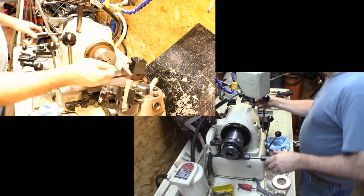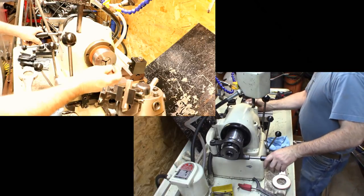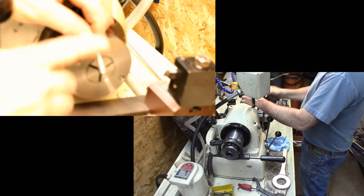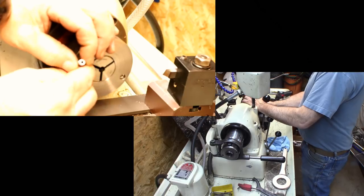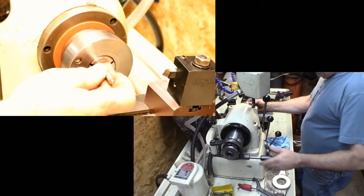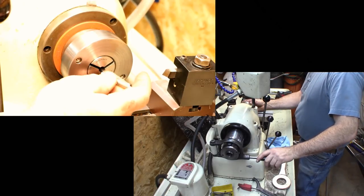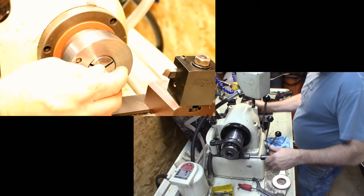Now we're ready to go on to set it. So here, this is a quarter inch collet, and we have one of our parts here that still needs to be finished for the scribe. Right here, this part. This bend's been machined and threaded, and the hole's been drilled, and still needs to be machined on this end. That slips in there. Now these collets open up a lot farther than a 5C collet, so it gives you a little bit more room for tolerance-wise, as far as being out of tolerance to grab something, actually.